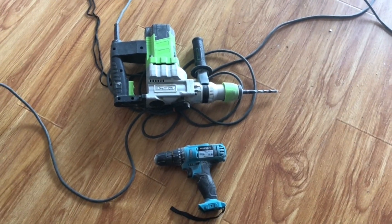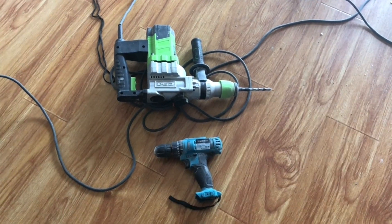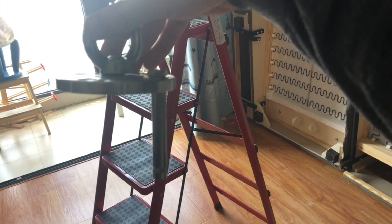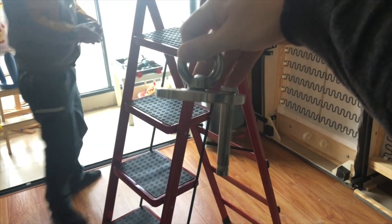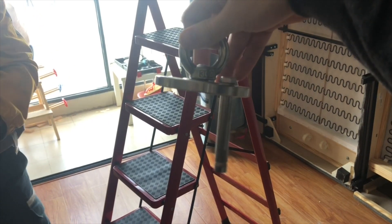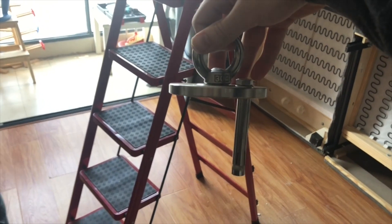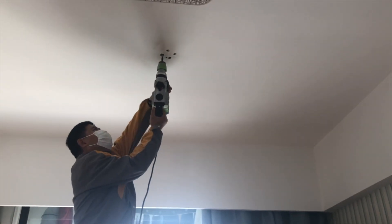So the lesson is: find yourself a handyman to put your holes in the ceiling if you have a concrete ceiling. This is how the bolts go in. You can see when they go in they take a little bit of length off the bolt, so you have to account for that when you're drilling your holes — account for that quarter to half inch of length the bolt needs to go through on the metal of this hook. He measured it with the tape measure and then measured up the drill bit accordingly.